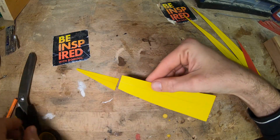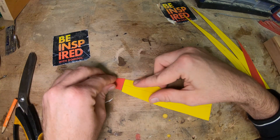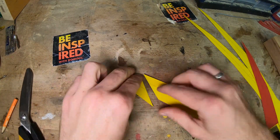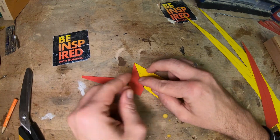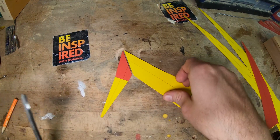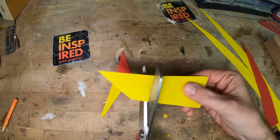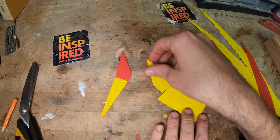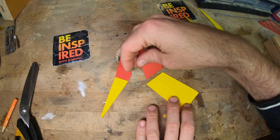The idea is that you cut a shape — you don't even have to taper it, you can use a dowel — but let's stick to two dimensions for now. You make a cut, and then you rotate one piece 180 degrees. Since both pieces came from the same cut, the surface connecting them will be equal. So unlike the tentacles I made, where I didn't rotate it 180 degrees all the time, you won't get anything standing out, any edges or whatnot.